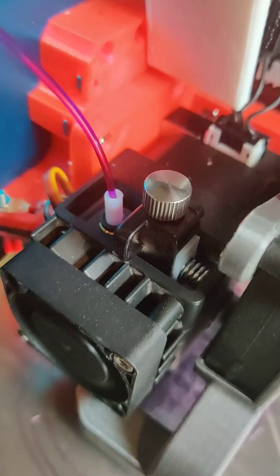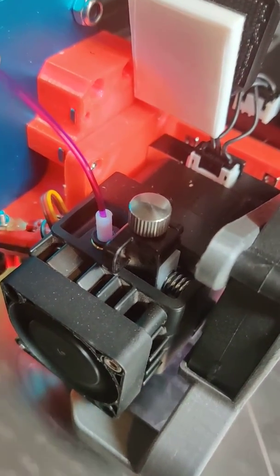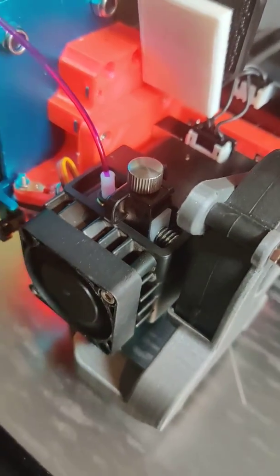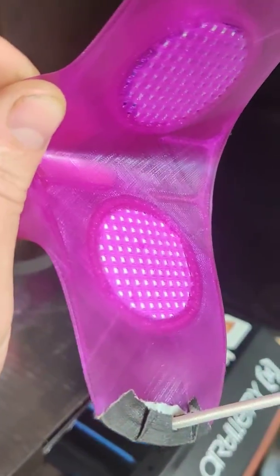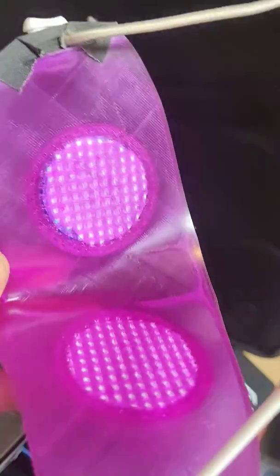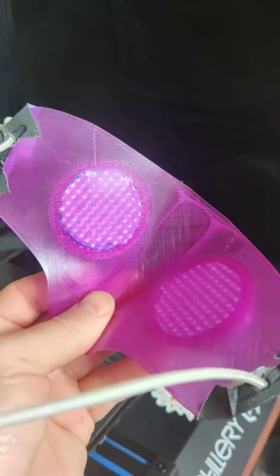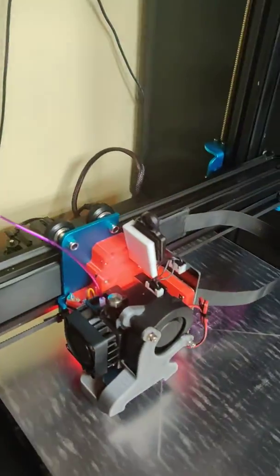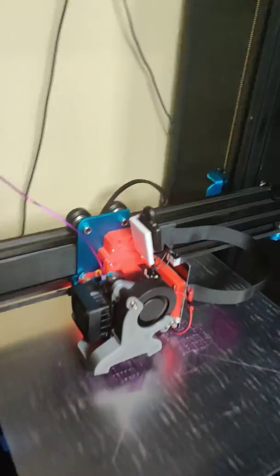You can see high sufficient compression right there. I printed this chunk out yesterday and it came out pretty good, but there are some extrusion issues I noticed throughout the print — some fat extrusions, some skinny extrusions. I kind of relate that to being TPU.